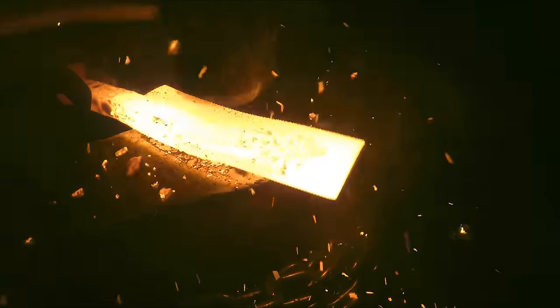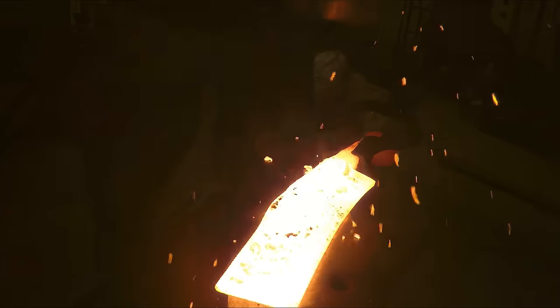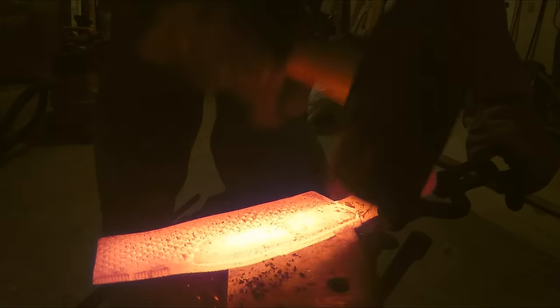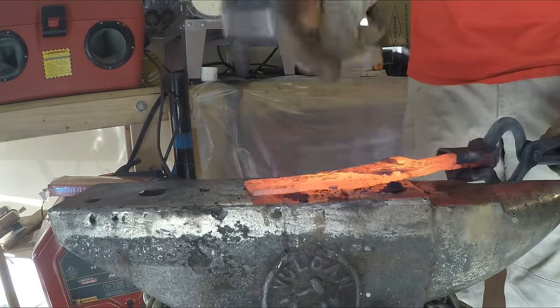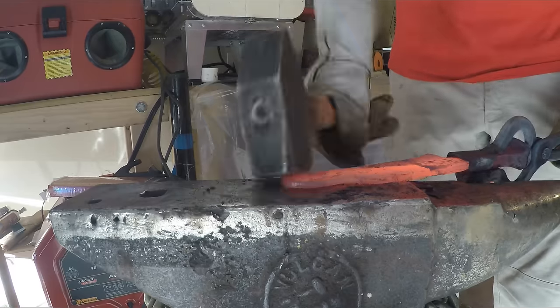The forge welding temperatures are pretty hot — usually people talk about 2100–2200 degrees for forge welding high-carbon steel. The steel is usually yellow to white hot, much hotter than the orange or cherry red you might otherwise typically forge at, which I'm pretty sure is closer to 1700 or 1600 degrees. All those sparks flying out are the borax — the fluxing agent I put in there to help prevent scale from forming during oxidation, which would otherwise interfere with the forge weld. Borax is non-toxic and inexpensive. As I'm straightening the knife and shaping the tip, there's no delamination and that forge weld holds up really well, so I'm pretty happy with that.